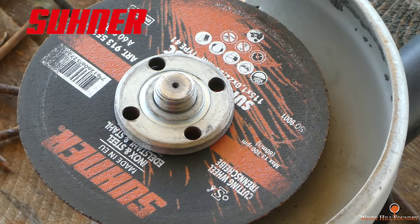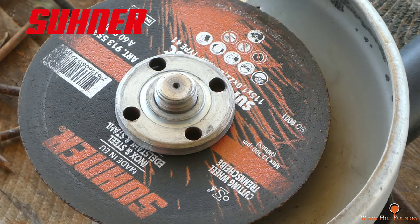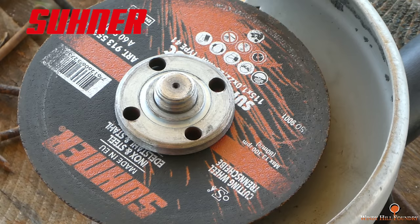This is almost white iron. There's a lot of carbides there, because I broke it out of the mold so fast, and I wanted it that way. I wanted to harden this material to a certain point. With that said, there's going to be a lot of internal stresses. Am I going to add a stress relief process to it? No. As I said, this is going to be temporary until we get some other plows made. And who knows? I may be using these things for 10 years.